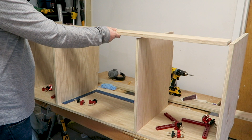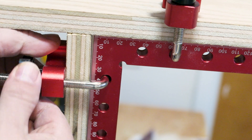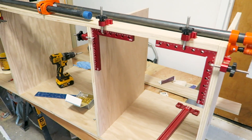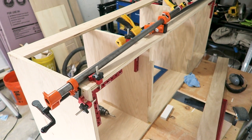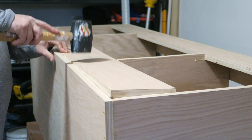Once the glue has a few hours to dry, remove the clamps and put on the front stretcher. The front and back stretchers are probably the most important parts of this carcass assembly because this is your last chance to make sure everything is square and all the divider boards are perfectly straight. Apply glue, use cabinet clamps to verify everything is perfectly square before driving screws, then do the same on the back stretcher. The final step is to attach the nailers to the back of the cabinet — slide them into the notches you cut out and attach them to the frame the same way you attached the stretchers, using screws and a little glue.